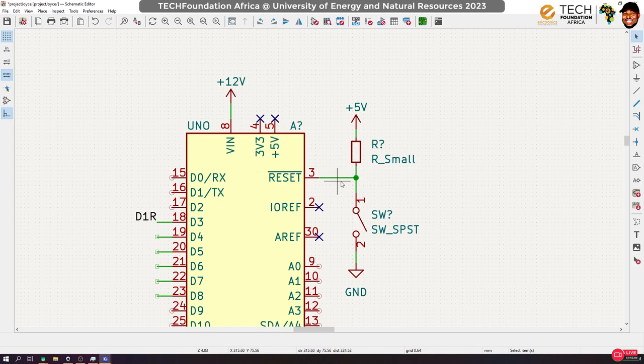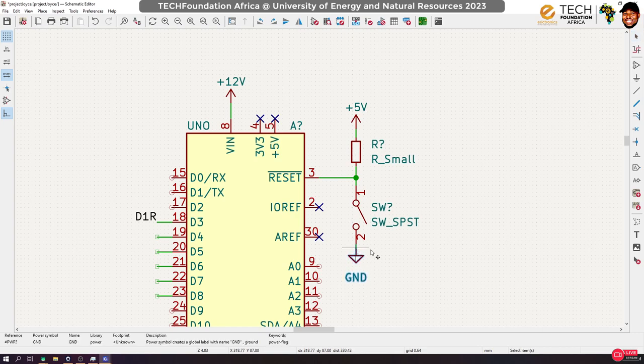So with Arduino, by using the reset pin, you can create your own button, or interface your own button, to do exactly that. And that's what we are doing over here, okay? This particular signal, you see the bar on top shows you that it is an active low signal. That means that to activate it, we need a low signal over there. And the way we can implement that using a push button is doing this particular thing.